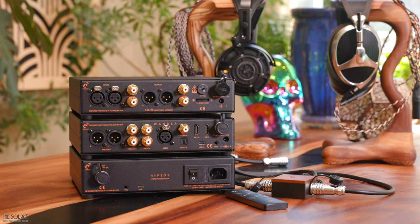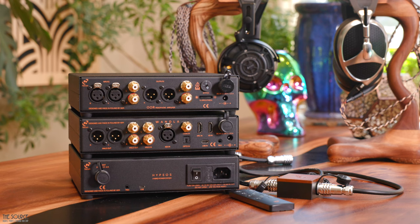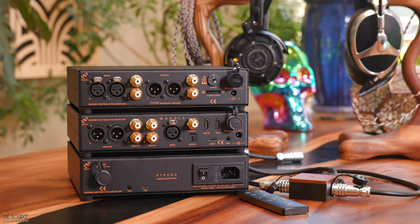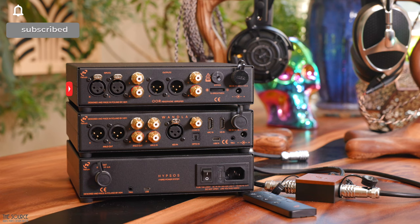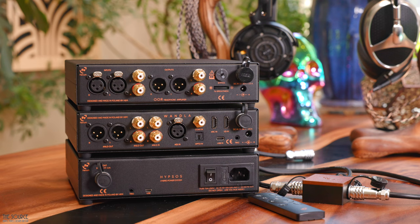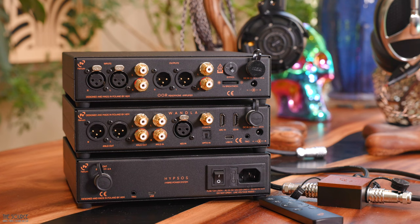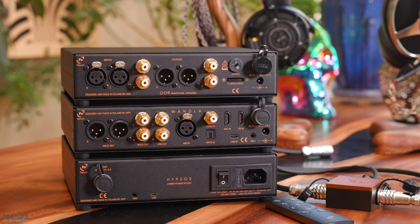This brings the total number of HQ Player custom Ferrum filters to four and one ESS filter, which I will discuss more in part two of this video series. The ES9038 Pro chip, capable of up to 768kHz 32-bit and DSD-256, combined with Ferrum's advanced current-to-voltage converter and CERC digital audio system module — Ferrum's optimized ARM chip — offers the shortest signal path possible, making multiple chips redundant. It also includes a built-in MQA decoder and renderer. The fully balanced modified IC pre-amplifier is fantastic. For those wanting a superb DAC that allows them to feed their amplifier as a pre with remote-controlled volume, the Vondula performs beautifully in this regard, even when paired with ultra-high-end audio research tube amplifiers.